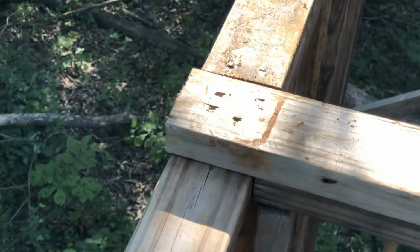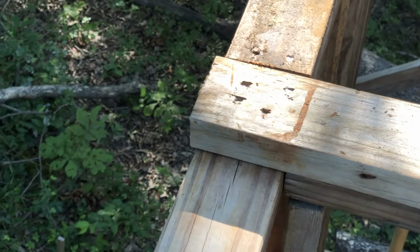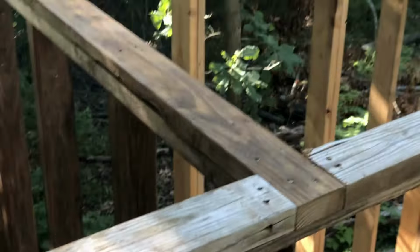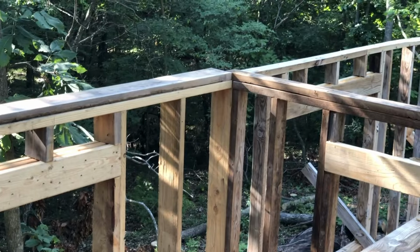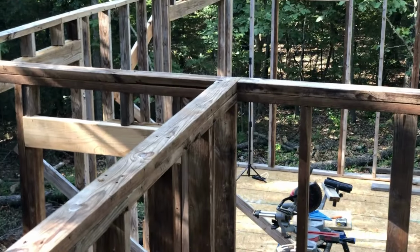Well, I messed up again. Thought I'd take a break to show you what I'm doing. I made that a little too long, so I'm going to run a skill saw over it and fix it, trim it up. But here's what I got going on. See how it overlaps? It really stiffens up the whole wall structure. I've got a weird situation in there because I've got this 2x6 wet wall, but it still works pretty good. I just half-lapped some of it where it made sense. Maybe I'll show you that detail, maybe not. But there's what it was when I started. I've still got to plate this whole top all the way around. So that's what I'm going to do.